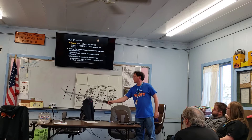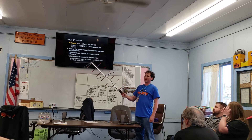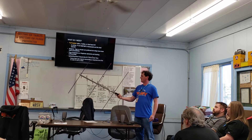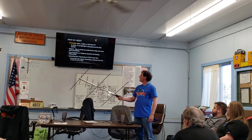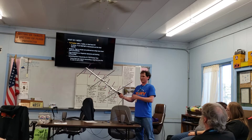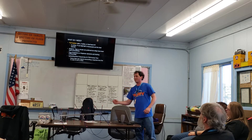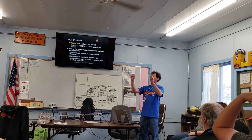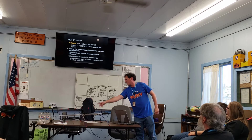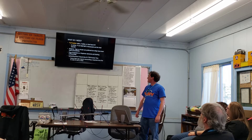For antennas, you're trying to point at that little satellite with five or six watts on a handheld, so you need some gain to punch through. This is an 8 dB Yagi from Arrow Antenna — that's what I've been using. It all breaks down and fits in a nice little roll-up bag. This is about the cheapest option at around $100; $150 with the duplexer built in. Base stations will often have two antennas or a circular polarized antenna, possibly with an automatic rotor and CAT control. On this Yagi, the long elements are VHF and the short ones are UHF.